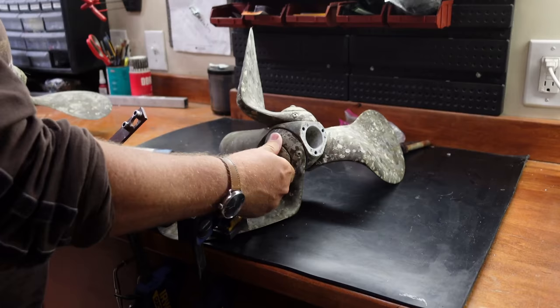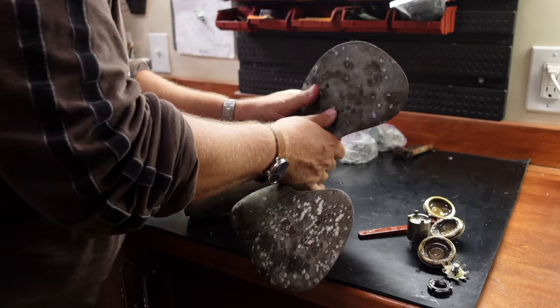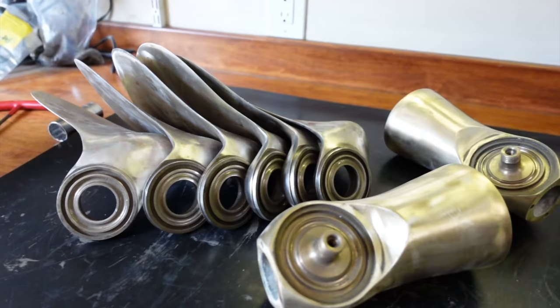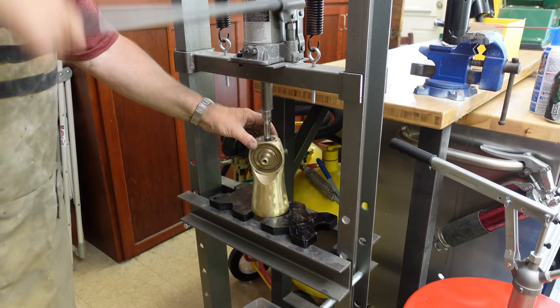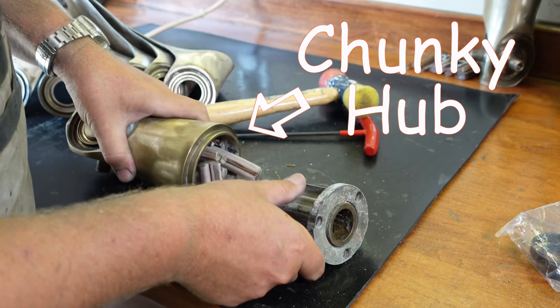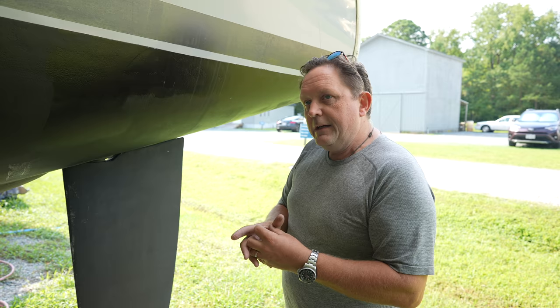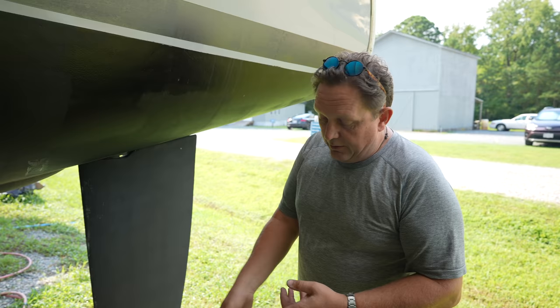So you asked me why they came loose, and the bearing tracks did have some little rumble marks in them from the bearings, Brinell marks. There's an internal spline with rubber dowels around it. That's why the hub's so chunky. They're called Vulcanised rods, and there are 12 of them going around it. Those had started to decay and two or three of them had collapsed, so there was play in them. I think, given what I've seen, it is possible that was contributing to some of your vibration.